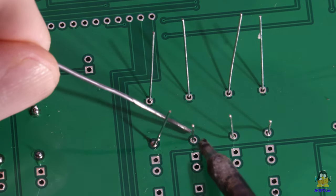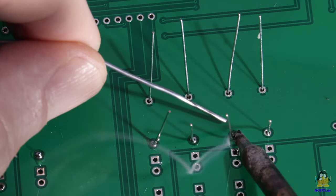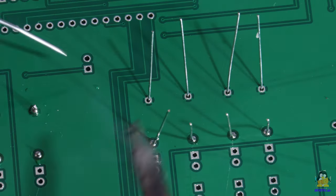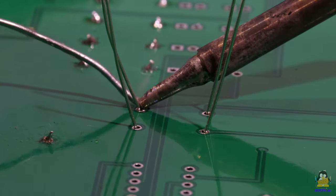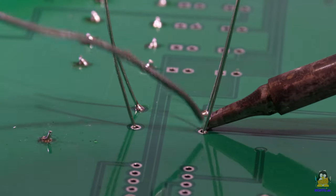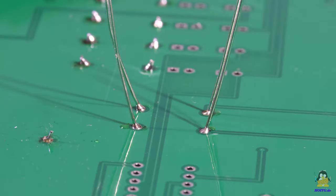This is mainly due to the applied solder mask, which is a heat-resistant plastic coating that exposes the blank metal only on the soldering points. Thus, the solder is limited to the specified area, which means that even not so skilled tinkerers can produce error-free solder joints.